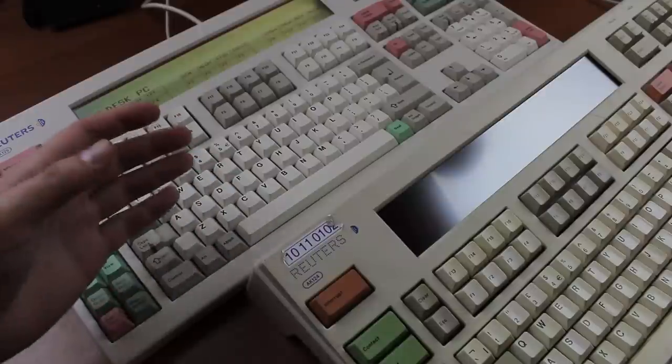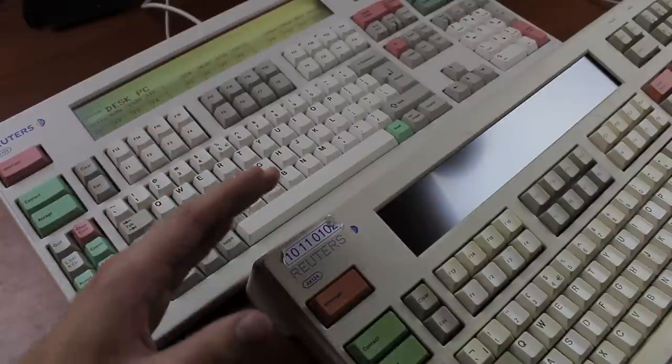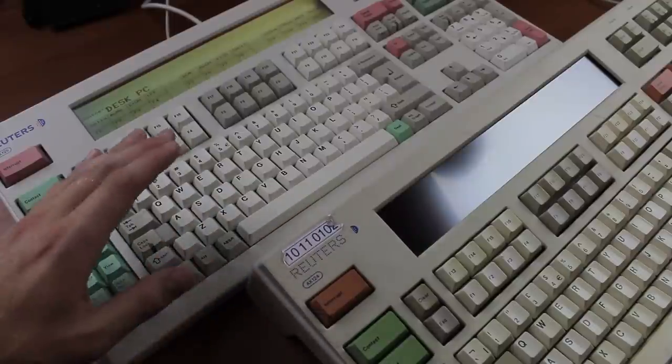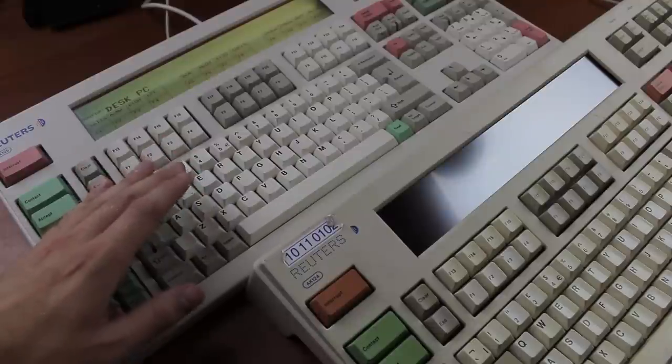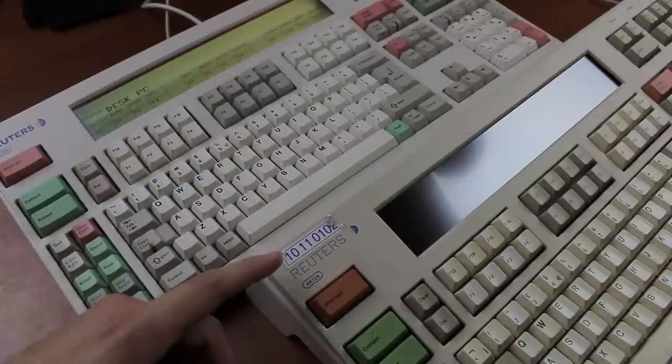The electronics inside differ a bit between the two versions as well. The older AK-124, the real 9009, uses normal soldered-through components, while the 9039, which is the AK-125, uses surface-mounted electronics instead, and it lacks the built-in fuse that the older model had too.